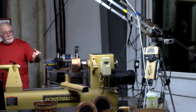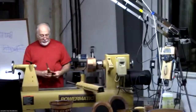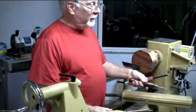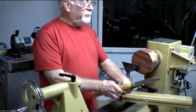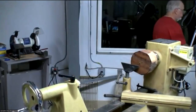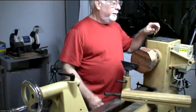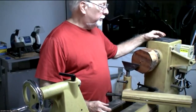Other tools that I use for the rings and buttons are various parting tools. This is a 1/8 inch fluted parting tool. I think it's Nick Cook's design. This is a 1/8 inch straight-sided parting tool, a P&N tool, with a Glaser handle. So it's kind of a hybrid. You want to pass them around? Angelo, were they made as coring tools or were they made as parting tools? No, they're made as parting tools. But for these little rings and buttons that I take out of the centers of lids, it's easy to use a regular parting tool rather than some kind of a coring tool.